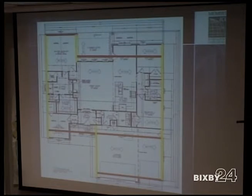I know that my minimum was 2 feet 4 inches, so looking at this sheet here, the ones that are stapled together, you can look at it and say, okay, on an 8-foot plate height here, I need 2 feet 4 inches. Do I have that? I only had 18 inches on each side here, so you kind of narrow down. What you're going to end up doing is try to narrow it down to as narrow as you can get. So what are my next methods then? So can I try CSPF?